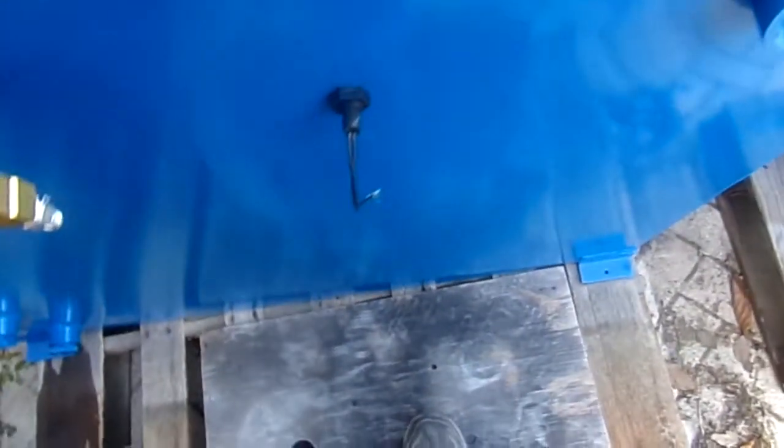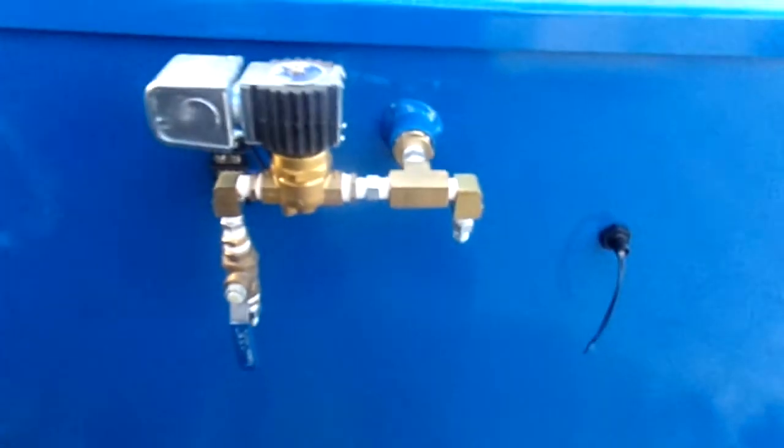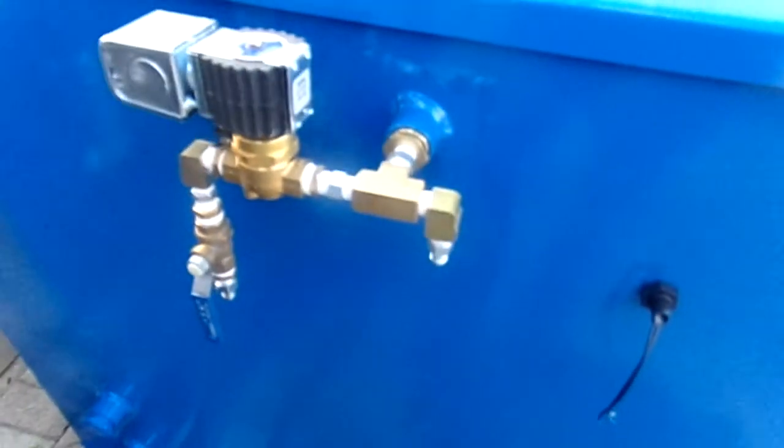I'm going to put the vacuum relief on it, and here's your high limit shutdown, and then your fittings will go in a box. These fittings will be put in a box, and here's what I was talking about, 12 volts here, ground there, so white here, black there at the bottom. That's thermal A side. I'll put a little sticker here, and this is B side. And you can line it up with what's in the rear of the machine. Real easy to hook up.